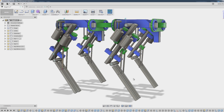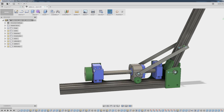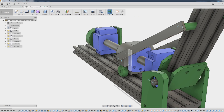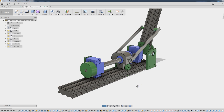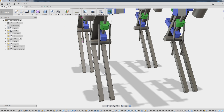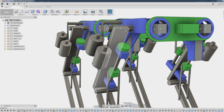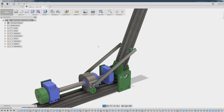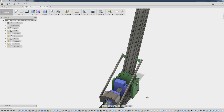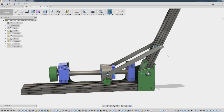Going from this rather basic design to this is now the detailed design, with the ball screw mounted at the right dimensions. I've drawn the blocks the right size with the mounting holes in, the ball nut with its mounting screws and so on. On the lower leg we've got this solid piece which looks like a 2040. The original plan was to use two 2020s spaced out so the rods could go between. I've now decided to run the wheels in both slots and put the ball screw in the middle. That's resulted in the push rods being right on the outside. I may replace those 2020s with a single piece of 2040, but for now we'll use the 2020s for prototyping.